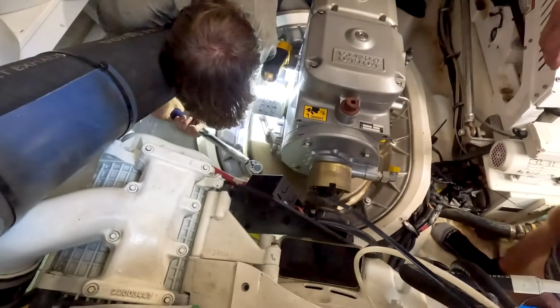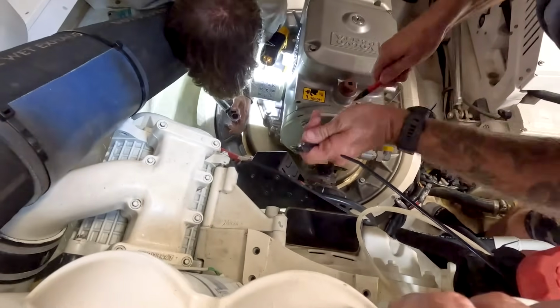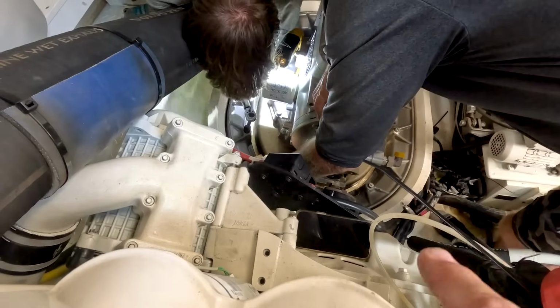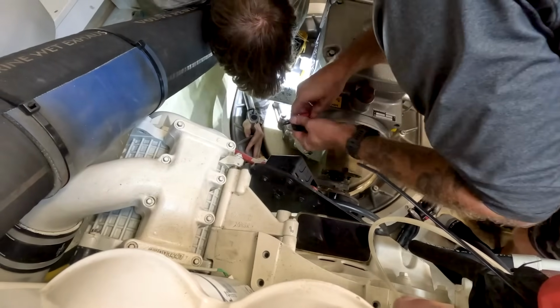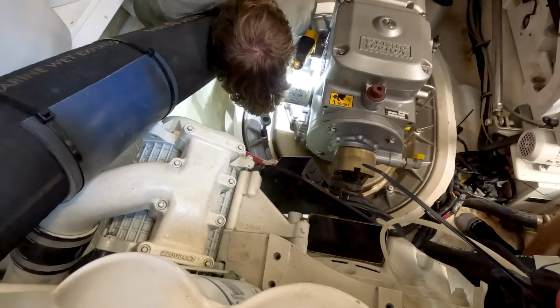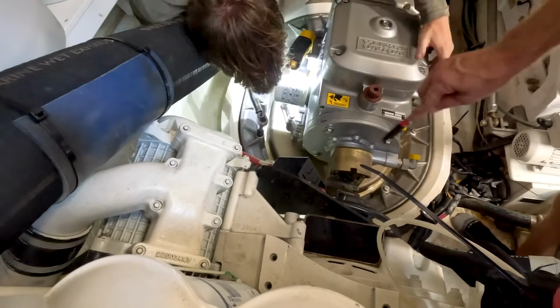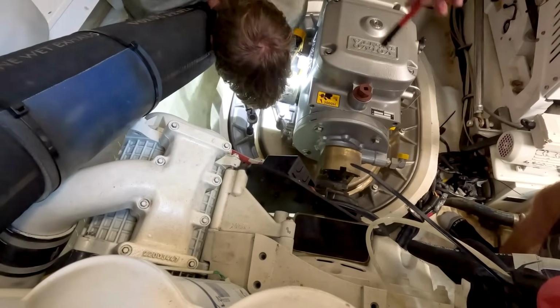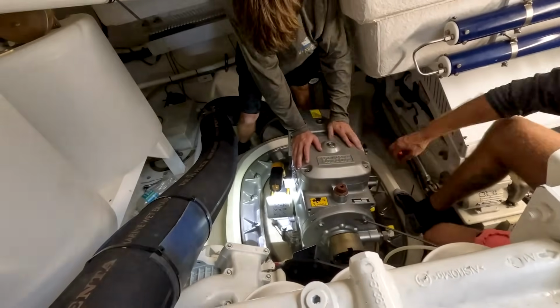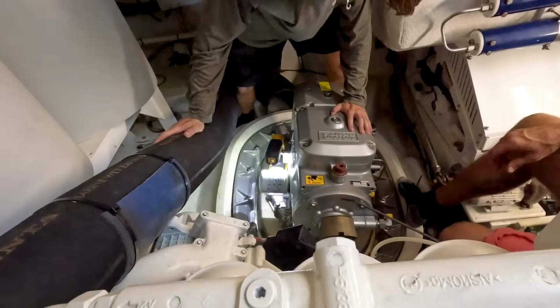We numbered all the bolts, and we're putting one slash on it for the first torque, and then we'll go back all the way around and put a second slash on it for the second torque. We are doing the pattern the manual said, 1 through 16. We started at 1, and the manual says to go in a circle, not a star. So you guys got all 16 torqued the first time. That's good enough for right now. We will double check the torques and slash the bolts after lunch.